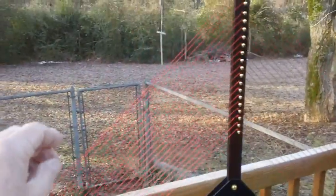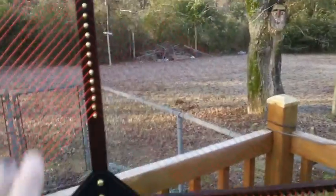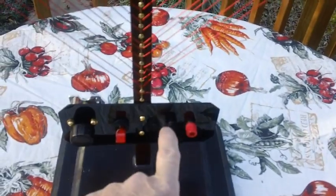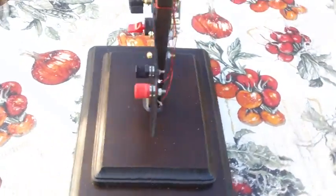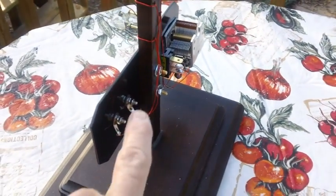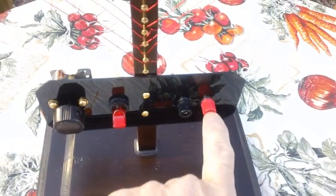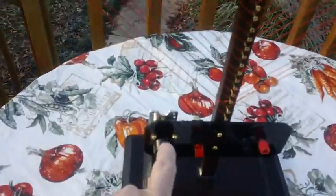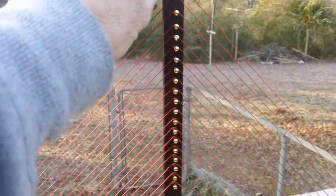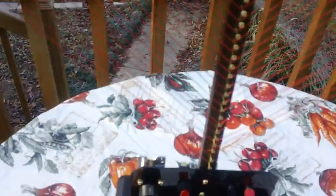That's about it. Here's the way that this thing works. The two outside wires that run all the way around the frame are connected to the two banana plugs. One end of the wire goes here and the other end of the wire goes there — on the back it's soldered on. I use little short banana plugs — I found them at Radio Shack. Just soldered one here and one there. These two wires go to the radio. The other massive wiring that you see here comes down and is connected to the tuner. There is no physical connection between the two outside wires and the rest of the wires — it all works off of inductive coupling. It's kind of interesting the way this thing works — I was really fascinated by it all.